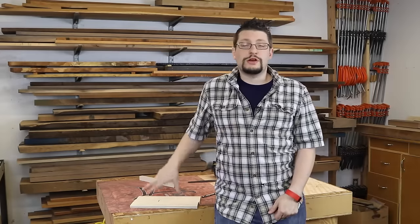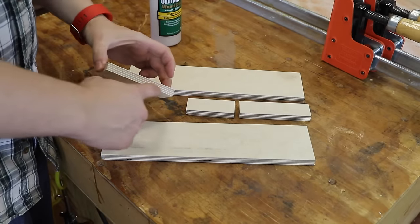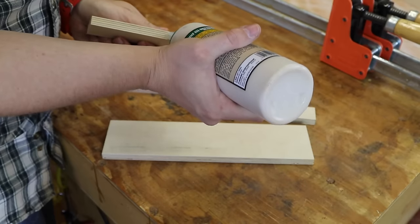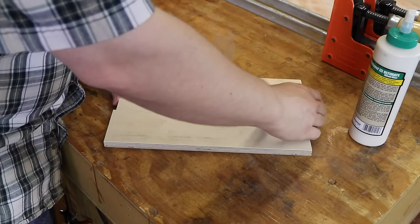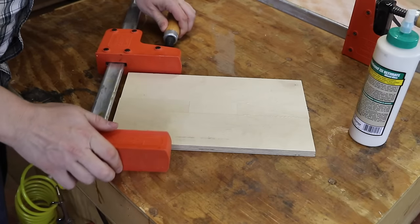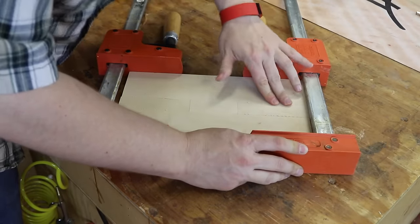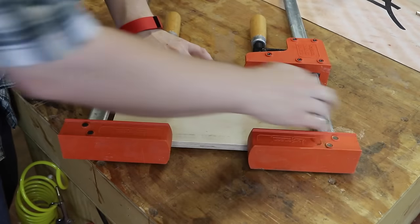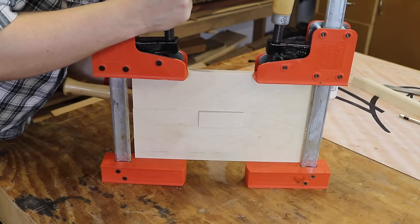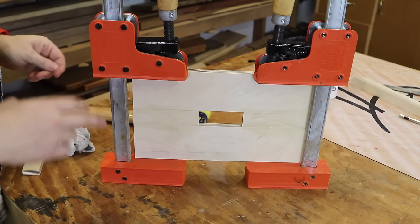What I want to do is get the camera over here and walk you through gluing this up. Here are all the parts, and I've got some Titebond 3. I'm going to apply glue onto these outer pieces and not to the spacer, which is the window for our mortise. I'm just going to get everything together and grab a couple of clamps, make sure everything is nice and flush, and everything is tight against this spacer piece. Then I'll knock out the spacer, clean up my squeeze-out, and let this sit for a half hour or so.